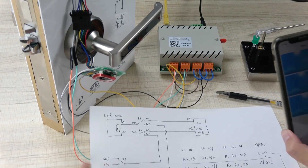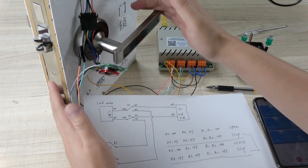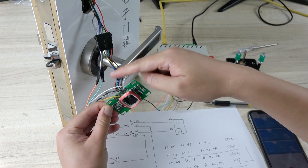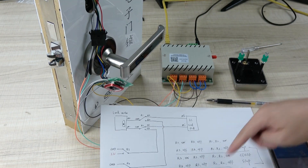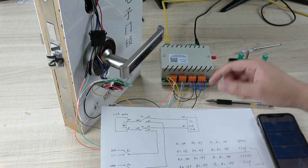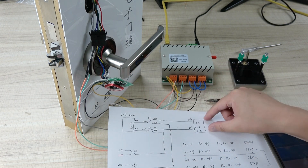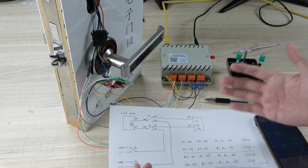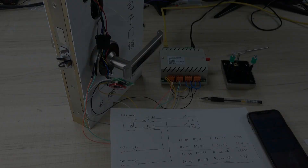This is how to DIY and make your door lock smart. Every door lock has a motor — just find the two motor lines for positive and negative, connect them to the controller, and use four relay outputs to change the motor direction and switch the motor line between the IC card PCB and the relay controller. It's easy to DIY to make your door lock smart. Thanks for watching.